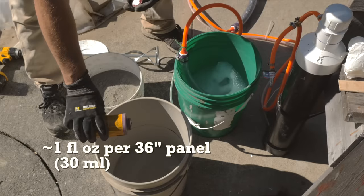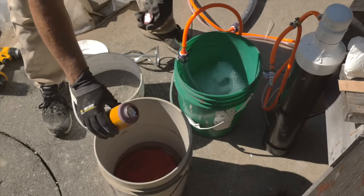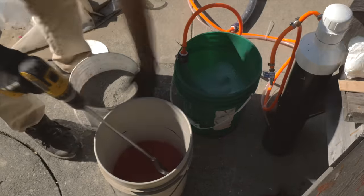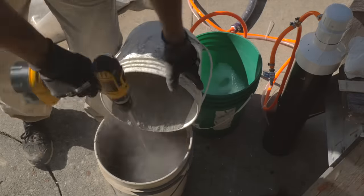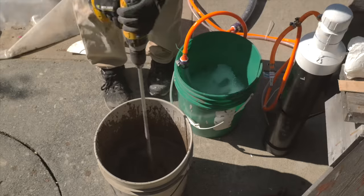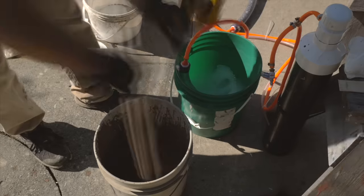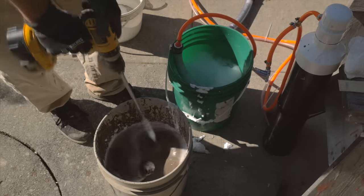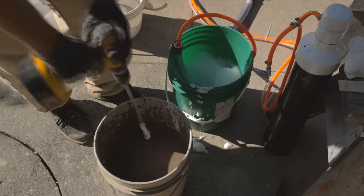For the next test, I'll add about one fluid ounce of red liquid cement color to the water. I'll leave out the fiber on this one. I make a smooth cement slurry and add the foam. This aircrete came out a light chocolate brown color. I blend it well and pour it into a form, and lay in a double wire mesh and smooth with a trowel.